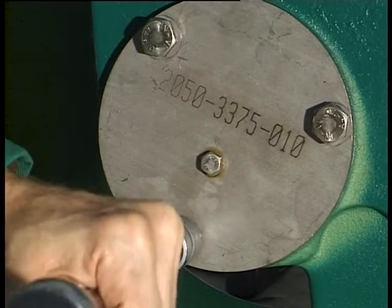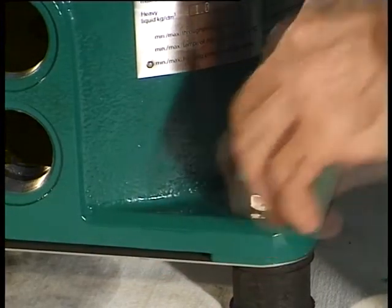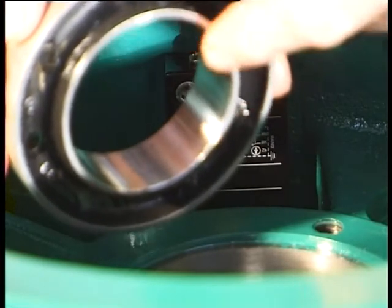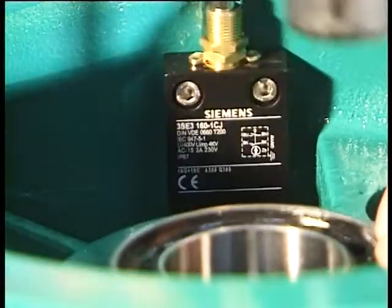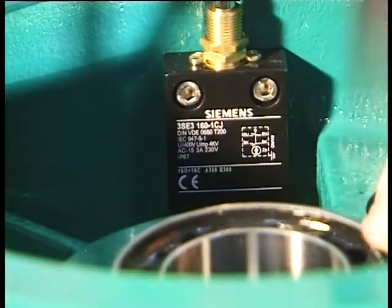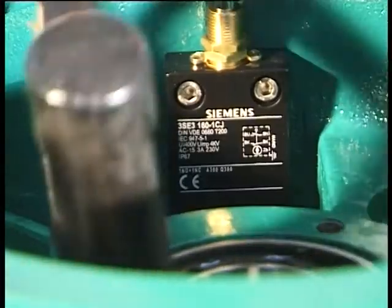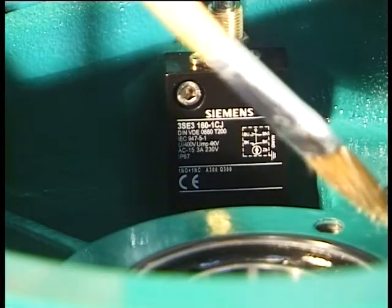Turn the lower section of the frame through 90 degrees. To avoid accidents, fit the guard — protection against contacting rotating drive parts beneath the separator. Place the lower section of the frame on the plate and bolt tight with four hexagon nuts. Carefully fit the rubber metal cushion; the inner protruding pipe collar must point downwards. Lightly hammer the rubber metal cushion evenly into its seat with a mallet. Insert the gasket in the groove. Grease the gasket and guide surfaces of the rubber metal cushion as specified in the lubrication schedule.